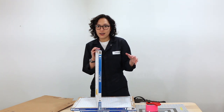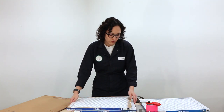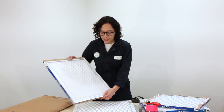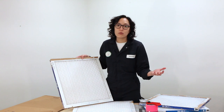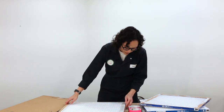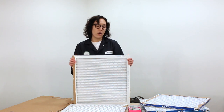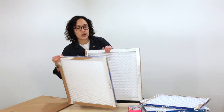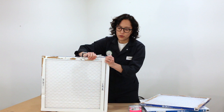It's really important to make sure the filters are oriented correctly so the air goes the right way. I like to lay out all my filters — some of these I've used before so they're a bit rough. This is the Filtrete 1900, and you can see it'll say MERV 13, which is a comparable filtration level. We're going to look for the arrows on each filter; when we make the fan box, we want the air flowing in and then out of the fan, so we need all arrows pointing inwards.